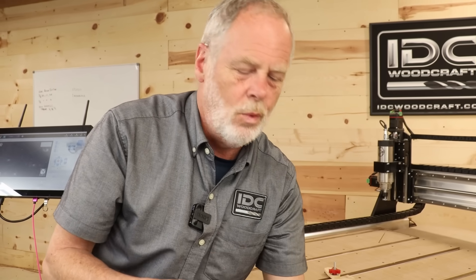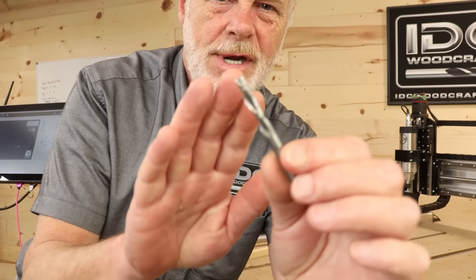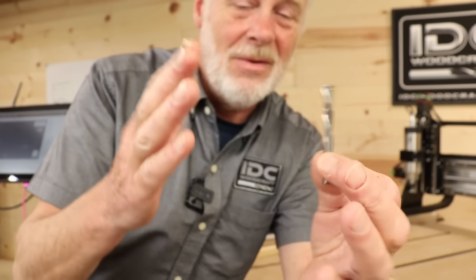With a one-inch diameter tool, 10% step-over is 0.1 of an inch. But what if you have a quarter-inch diameter tool? You take the quarter inch and divide it by 10 — that's your 10% step-over value. A 50% step-over for a quarter-inch diameter tool would be one-eighth of an inch. The step-over percentage is always based on the tool's diameter.